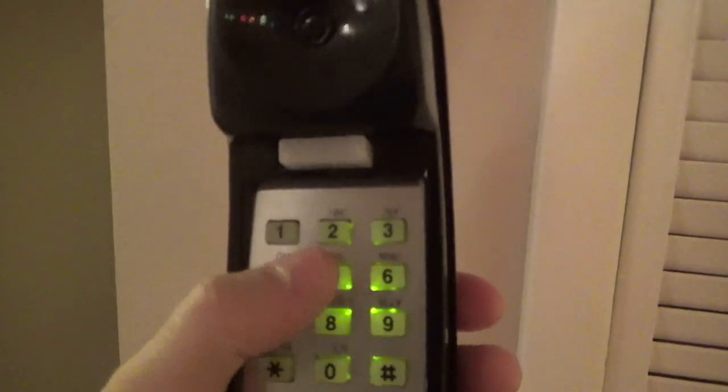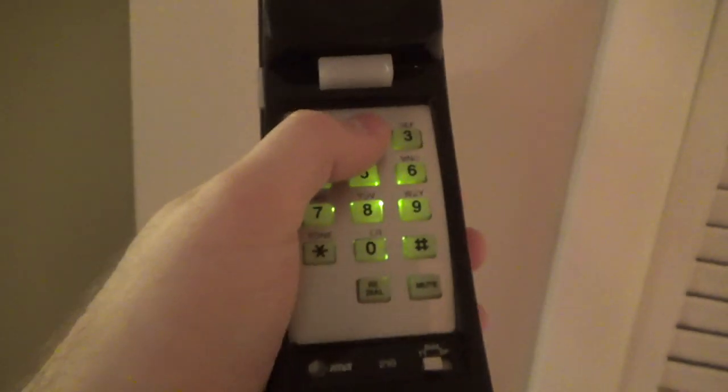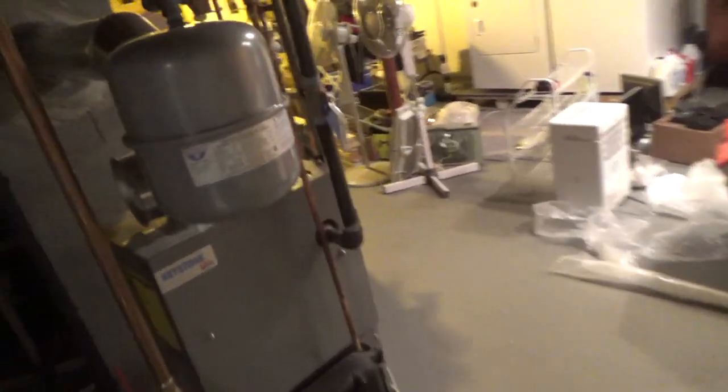So I'm going to put on the DC voltage booster. Just as a comparison, the phone works fine now, but when I press the buttons to make the tones, well, you're not seeing it on the video here, but the backlighting dims significantly. So there is definitely a lack of voltage, which is to be expected, considering how much equipment and how much wiring the signal is going through.